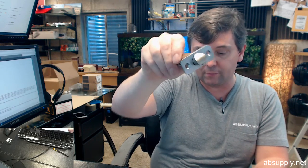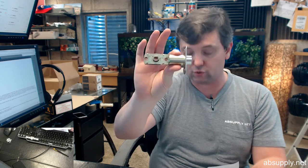Step 2, always with a tubular lock and with a cylindrical lock for that matter, you install the latch bolt first. Make sure that you get its orientation correct, depending on the swing of the door. They say install the strike after that. I like to put the strike in after I've got the lock completely on so that I can test the alignment of the strike of the latch bolt with the strike. Your 2 cylinders go in.